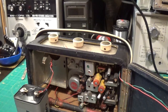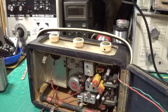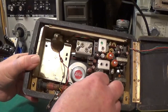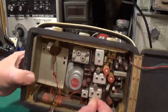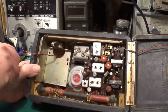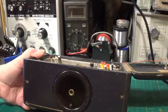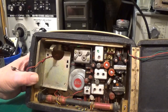That tells us the story that it would work if that transistor was working. So let's take the battery off. We're going to look at replacing at least this transistor, more than likely all three. I think this one has been replaced because it's a different manufacture — this is a BEI AF116. That should be an AF117, so that's a sure sign someone's been in here. To get the chassis out you just pull these wedges out — there are two screws here, though they were very worn.